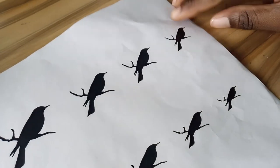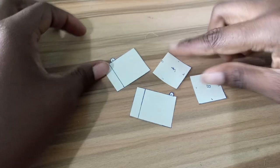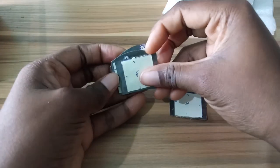The design plan was to make a hinged pendant from four metal pieces — two on one side and two on the other side, with a bird profile in front and a family picture inside. The two pieces on each side would be riveted together and a hinge would hold the two sides together.